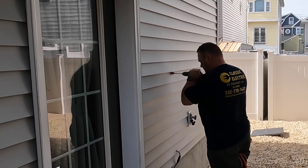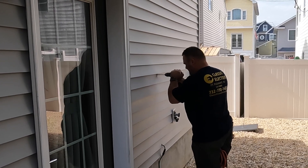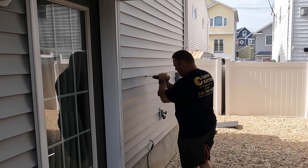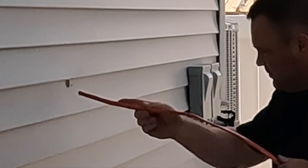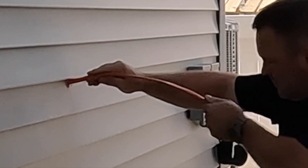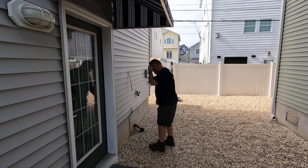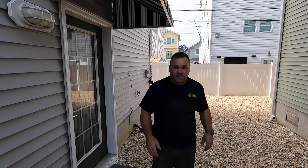After making a half-inch hole for my portable generator wiring feeder, I drill a pilot hole to the outside. Once I know where that location is on the outside, I'll come back with the appropriate size bit so that the connector in the back of the inlet box won't obstruct or make the box sit awkwardly. Then I'll feed this — it's 10-3 with ground — these are my feeders for the portable generator wiring. We'll terminate those for the generator later.